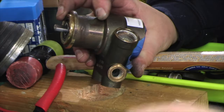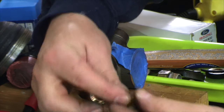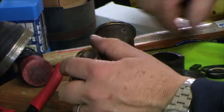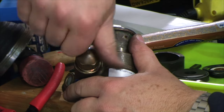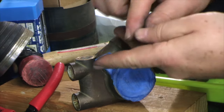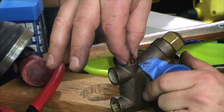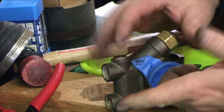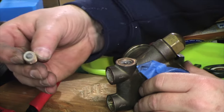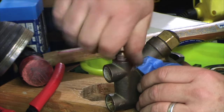The last few bits are things like the pressure relief valve, spring, and related parts, plus the new filter — that would go in. There's a seal on this that we showed earlier — don't forget to replace that if it leaks. The best way I've found is to set the pump up, drop in the filter, take your new spring and drop that in. A little dimple slides in — throw it in by hand, get it tight, and don't worry about adjusting the pump pressure right now.